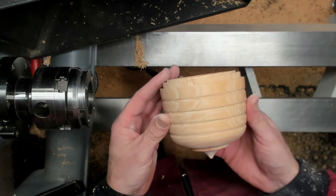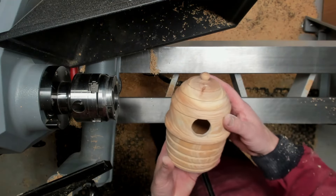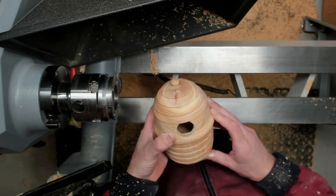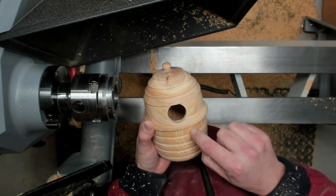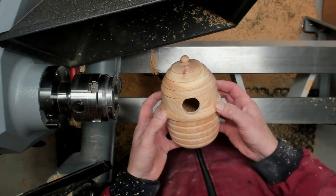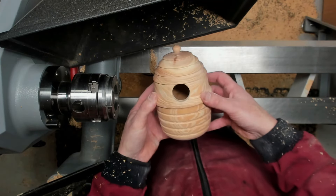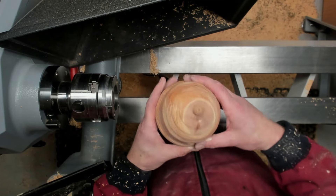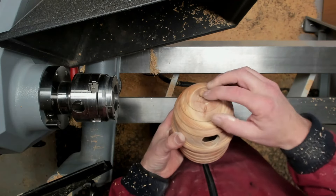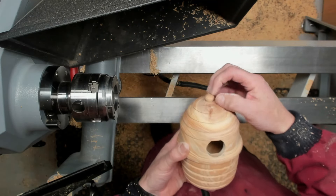So now that's our base just finished. We just want to turn a little small perch for it, and then I'm just going to drill and put a couple of pins in it so they can be removed for cleaning-out purposes. I had a little bit of material left so I just put a little detail on the bottom. Same on the top — I left a little knob so I'm going to stick a little metal eyelet in that so I can hang it up.